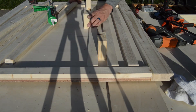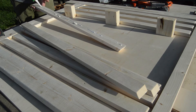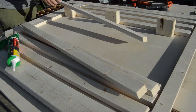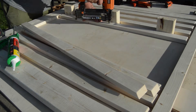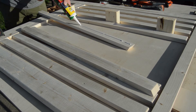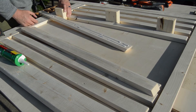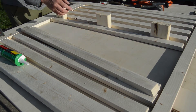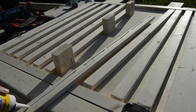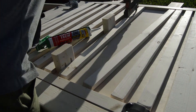I'm also using some pin nails. Since I'm using stop blocks after each vertical piece, I didn't want any risk of a piece moving, so I'm running some small 18-gauge pins just to make sure everything stays in place. In Meredith's barn door project there were zero nails holding that design together, but since I'm having to use stop blocks and use the previous piece to line up the next piece, I just have to make sure nothing moves. Key note: it will dry in one hour but takes 12 hours to cure, so after finishing all the vertical slats, I allowed it to dry for 12 hours before doing any sanding.